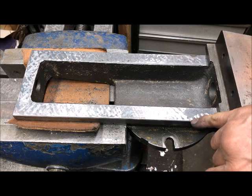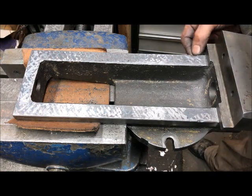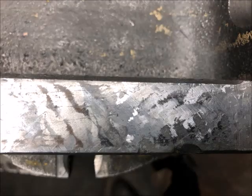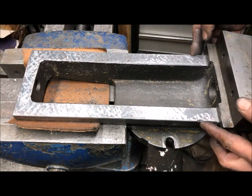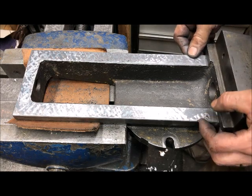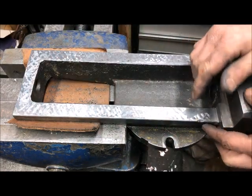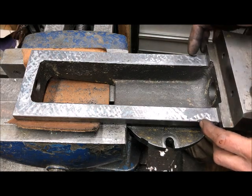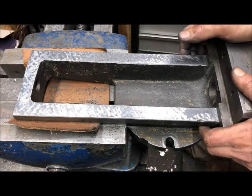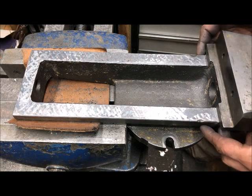There are a couple of marks here — a hacksaw mark or something, and some marks that might be from someone having a milling cutter down here. I could do something with that, but since this is on the sides I'd have to actually weld it up, which of course risks distortion of the whole thing. The benefit would be more or less cosmetic — this isn't doing anything accuracy-wise or for support. I could just fill it up with some softer material afterwards, just for the sake of having it look good. We'll see.